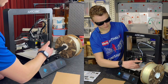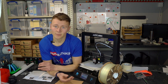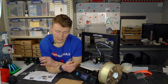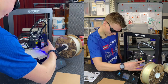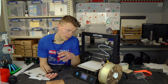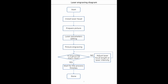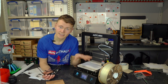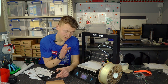So that does need to be adjusted. To adjust the focus you have to tighten this. I couldn't see in the guide that there was any sort of assisted setup for the focus, so it might be a case of just doing a few passes. I've just done one little tighten. I upped the laser height to 10 and then as it was printing, adjusted this little knob here — tightening and loosening it — until I got that really tight point.